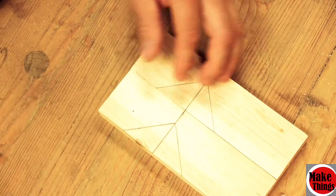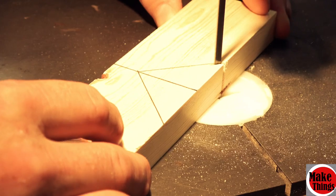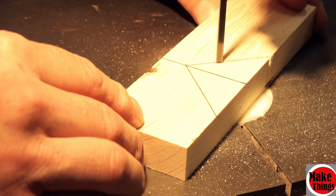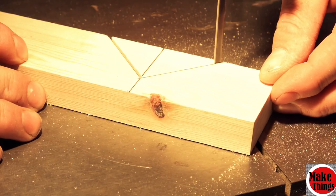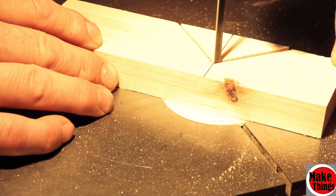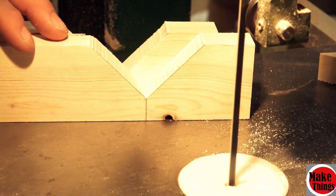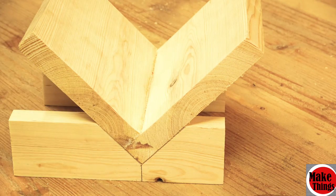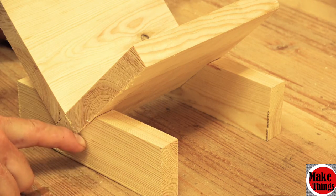I use a 5-degree mark as the base point to draw the 45-degree angles. After both are marked, we'll hit the bandsaw and very carefully cut out the area between the angles we created. When both have been fitted with the cradle and all looks like it fits perfectly, we'll focus on cutting the horizontal end of our cradle base, measuring an inch from the V we cut.